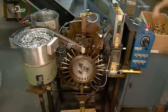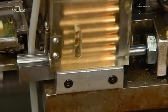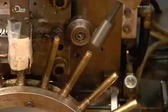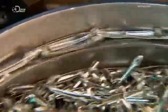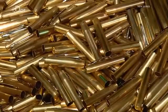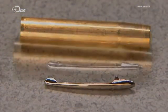Certain space pen models have a cap for the pen. A feeder places a brass cap on each spoke of the cap assembly machine, which then pushes the cap into position to receive a clip. The clip is stamped out of spring steel, which is a fairly flexible metal. It's chrome-plated for corrosion resistance and looks. The machine drives the clip's teeth through the wall of the cap, then curls them back towards the inside of the wall, locking the clip in position.